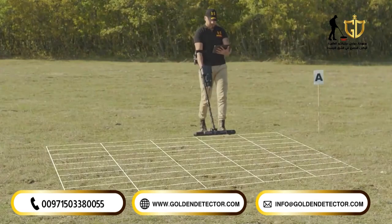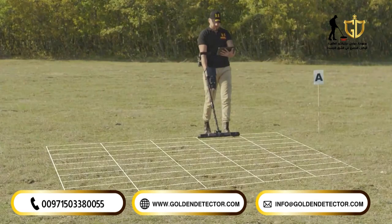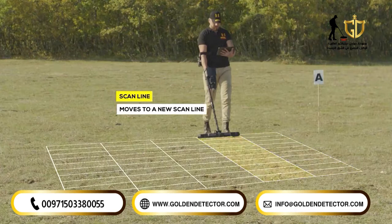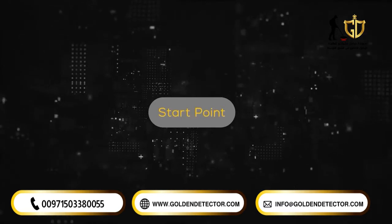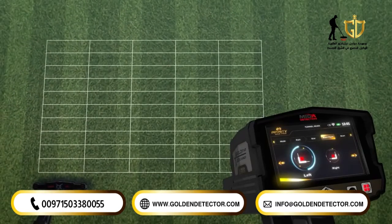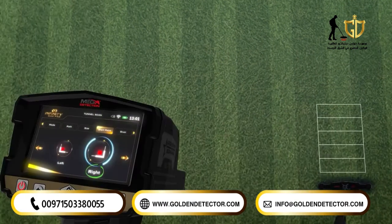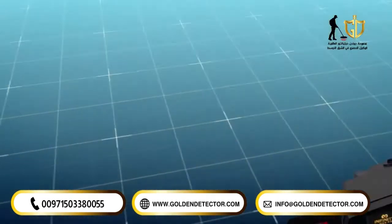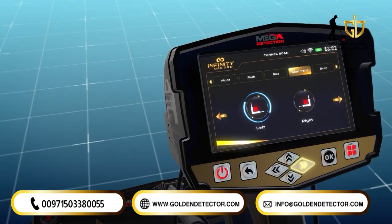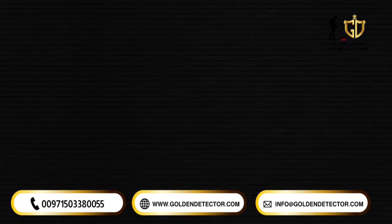And every time the user moves to the left or right, it's called a scan line, meaning he moves to a new scan line. Start point. Here, the user can specify the starting point of the scan within the area, and there are two options. Left: the start of the scan is in the lower left corner of the scanning area. Right: the start of the scan process is from the lower right corner of the scanning area. The location of the starting point can be selected using the left-right arrow buttons, then pressing the OK button.